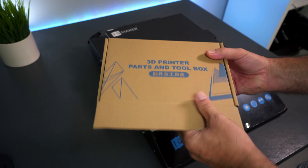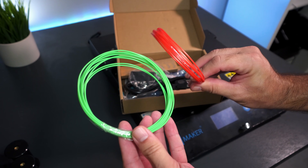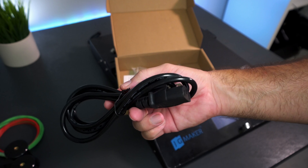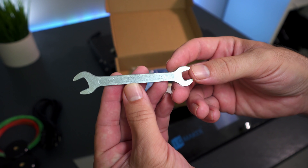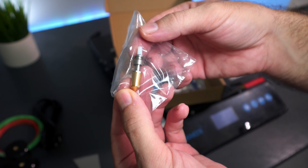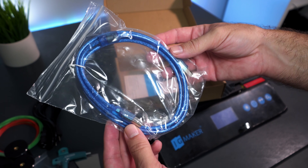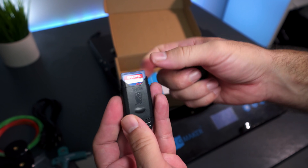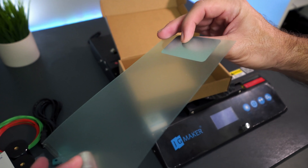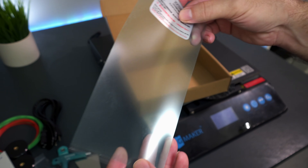Let's take a quick look at what's inside the parts and tools box. We have two parts of the spool holder, small coils of test filament, some hardware, an idler pulley, cutters - the nicer ones - a power cord, a sharpened angled spatula, a 10 and 8 millimeter open wrench, a set of hex keys, an extra nozzle. This printer has removable nozzle tips - like a quick release. We also get a USB cable, an SD card reader with a full-size 8 gig SD card, a warranty card, and a leveling sheet.